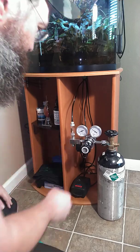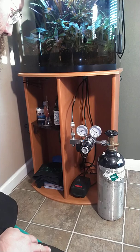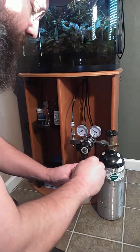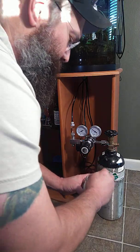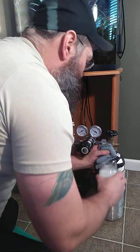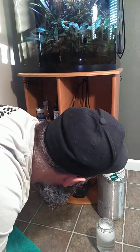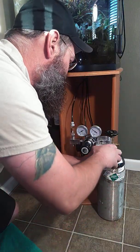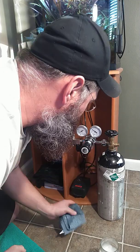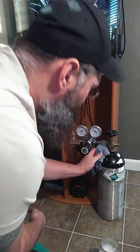There, so you got bubbles going. We'll let the pressure bleed down. You can see it's moving now — it's on its way down because this is all the way loose. But while it's doing that, I'm going to take some soapy water and test this for leaks by putting a towel underneath and just dumping some soapy water on the fitting there, looking for bubbles coming out. Pretty sure that was tight enough and I'm not going to get any leaks, but you're going to leave this alone for five months so make sure it's right. Maybe tomorrow check it again and maybe torque it one more time.